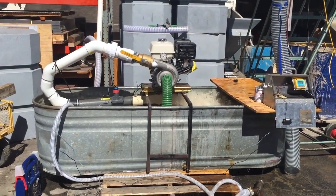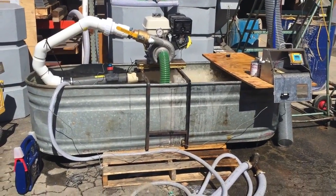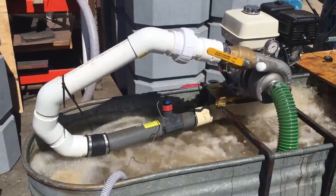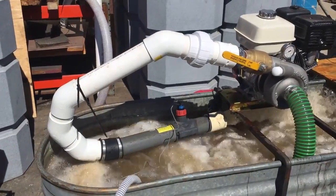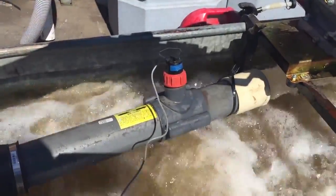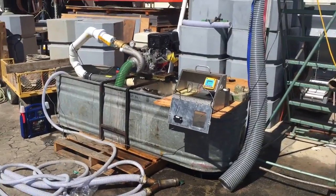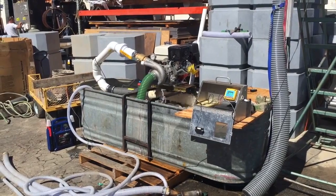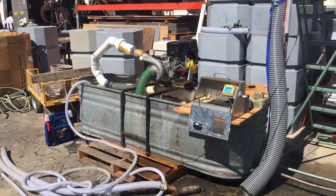You can see here we're doing some further testing on the pump for actual gallons per minute. We actually use two different methods: a meter that determines the exact gallons per minute, and an ultrasonic meter as well to determine the flow through the power jet. This close-up shot shows the actual pinwheel meter we use — there's a little pinwheel mounted directly under the red knob on the 3-inch pipe. This shot gives you a better view of what roughly 400 gallons per minute looks like. There are a lot of inefficiencies in that plumbing, but we're still doing quite a bit of GPM.